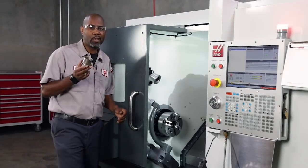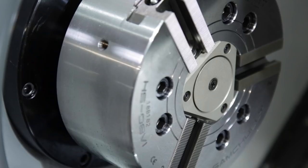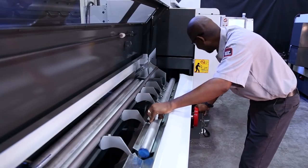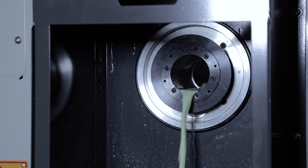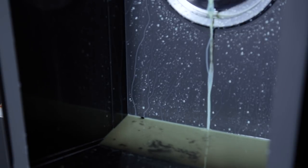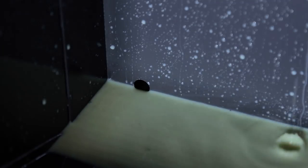You should keep the center cap installed on your chuck and the back cap installed on your union whenever possible. But if you're running long bars or you need the draw tube open for some reason, then be aware that coolant will flow through the draw tube and will spill out the back into the coolant collector. This is normal and how the system works — that's why we call it the coolant collector.